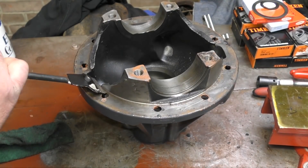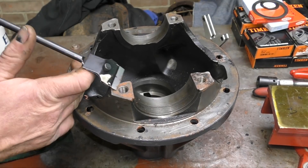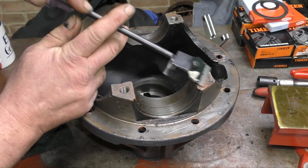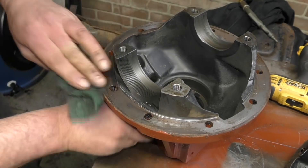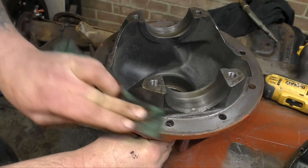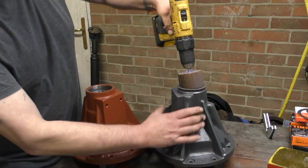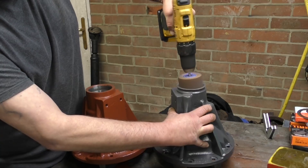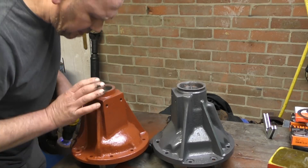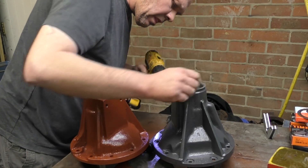It'd be crazy to use an angle grinder, obviously, because that'll take metal off. This surface here — I've got a little bit of paint on it. I just remove it and then blow it out afterwards. I don't want anything stuck on here at all, as it needs to be a machine fit together with the caps. Scotch-Brite is absolutely brilliant for removing grime and brightening up surfaces without leaving noticeable scratches. I'll have to clean the paint out here where the seals sit. Flap wheels are easily available on eBay.